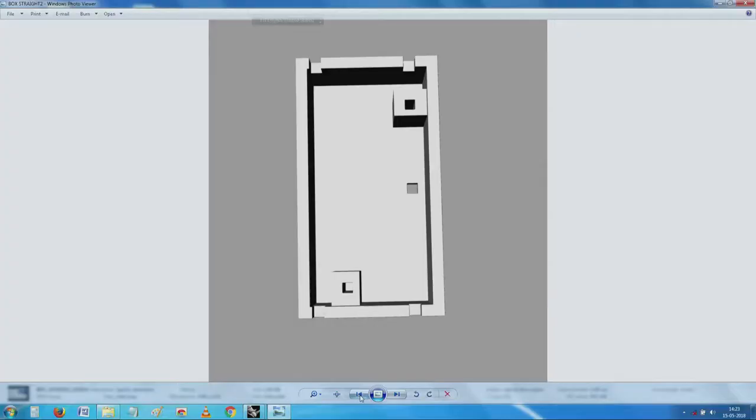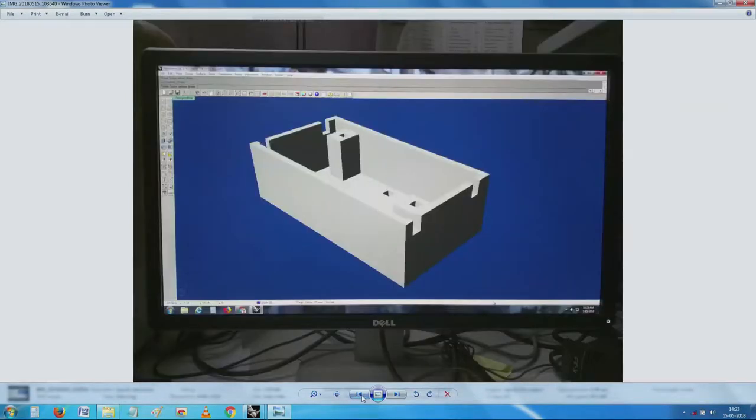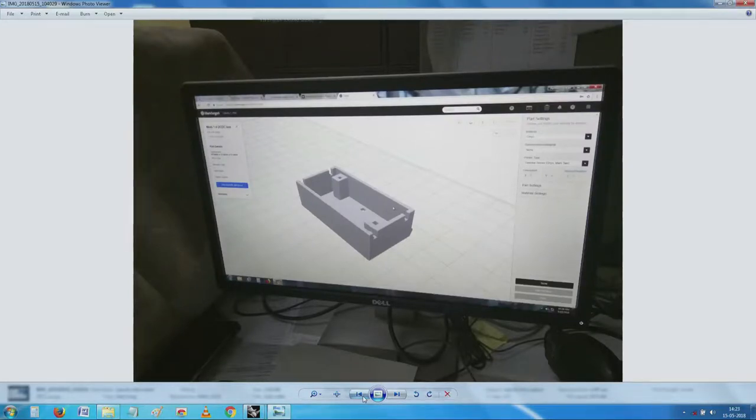The thickness of the walls shown is two millimeters here, but actually in the drawing it is only 1.4 millimeters. 1.4 millimeters is very very thin - typically about as thin as these items - and it is quite strong. If it is supported in both places it is quite strong. This is the other side of the box, shown for illustration purposes. The wall thickness here is a little smaller and this is directly loaded into the 3D printing software.